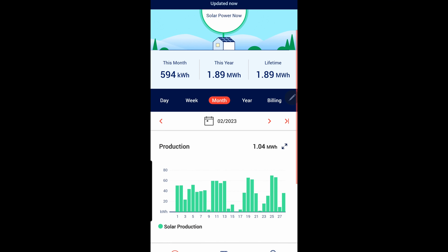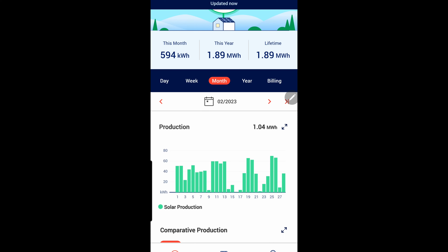So we've got the SolarEdge app fired up here. You can see down here in this section highlighted in blue, this is our total megawatt hour output for the month of February. This system put out 1,040 kilowatt hours of electricity, or 1.04 megawatt hours. Digging a little deeper, we had some pretty good production days — on the 25th we had 70 kilowatt hours of production. And on the lowest day, 431 watt hours, which is basically a full day of snow on top of the whole solar array.